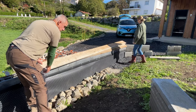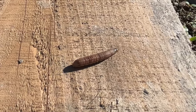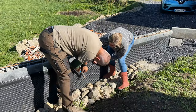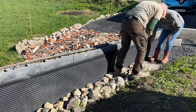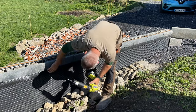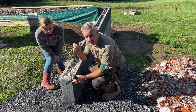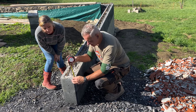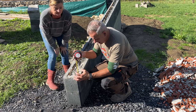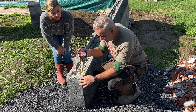So they don't fall on us, we'll just put them over here. We want two centimeters — just under an inch — of concrete above the gabions, which means this has to come up to 10 centimeters, which is about four inches. So we're going to put the forming boards allowing four inches or 10 centimeters to stick out above — that's the plan.